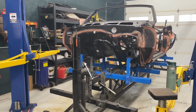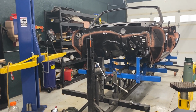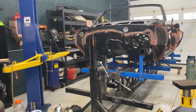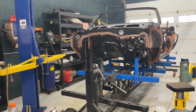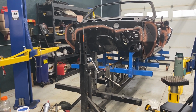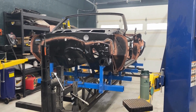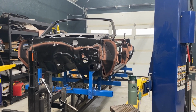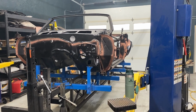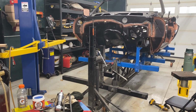Like I said, I'm going to clean up some of those welds tomorrow, and then epoxy it, get it all sealed back up. Then I'm probably on to start at least preliminary fitting of the rear quarter panels, tail panel, trunk deck, and pretty much the whole rear clip. Can't really finish any of that until the door hinges are back. That'll probably be another couple weeks, but I'm sure I'll have plenty more I can work on until then.